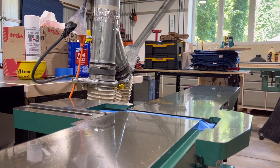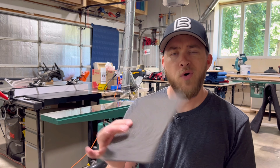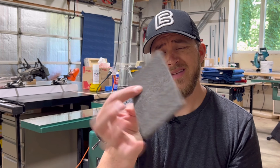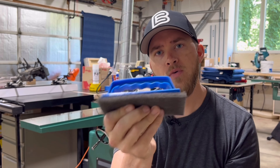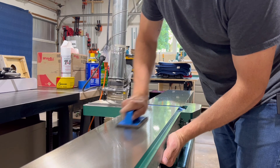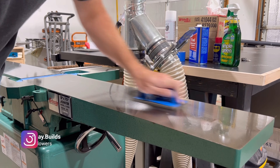Once it's fully covered, let it sit for at least three hours. Now that it's had time to soak, I'm gonna go over the surface with this gray Scotch-Brite pad which is just a really fine abrasive. It's also really helpful to get yourself one of these handles — you can cut the Scotch-Brite pad to be the perfect size for the handle to go right on. Any tools or materials you see in this video will be linked in the description below. Scrubbing the surface with this abrasive is gonna help remove any contaminants that are stuck on, even out the surface, and take out some rust areas you may have.